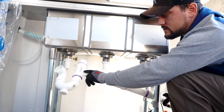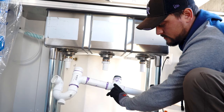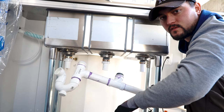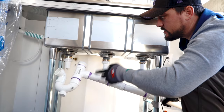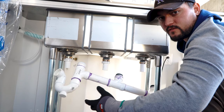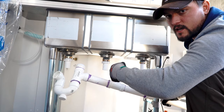I realized when connecting my sanitary tees that I had put the end one on the wrong way, so I went in and fixed it - flipped it so the water flow comes in and goes down into our p-trap. My health code department doesn't require a p-trap because they require the gray water tank to be 15% larger than the fresh water tank, so theoretically there's no risk of back flow. But you could still get odors from the gray tank, so the p-trap stops those odor gases from coming back into the trailer.